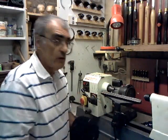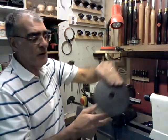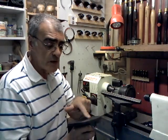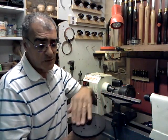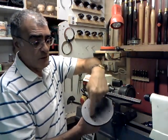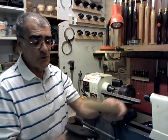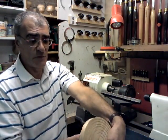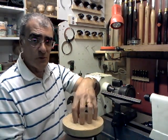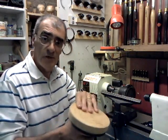It also comes with a face plate. A face plate is for face plate turning — it screws onto the spindle on the headstock and you attach your workpiece by means of screws. If you want a small workpiece and you can't screw it down because the screws have a certain radius, what I did was turn a circular piece of wood, screw that to the face plate, and then use hot glue to stick your blank to start turning. I don't use that anymore since I've purchased a chuck.